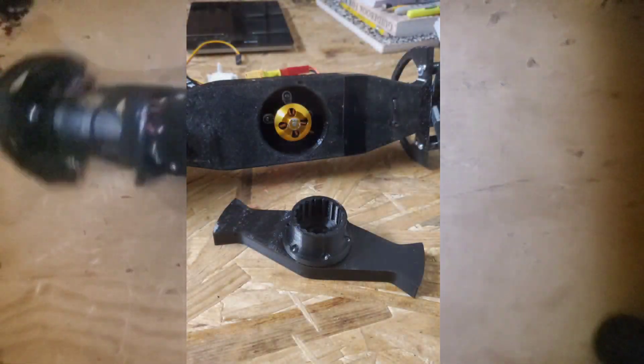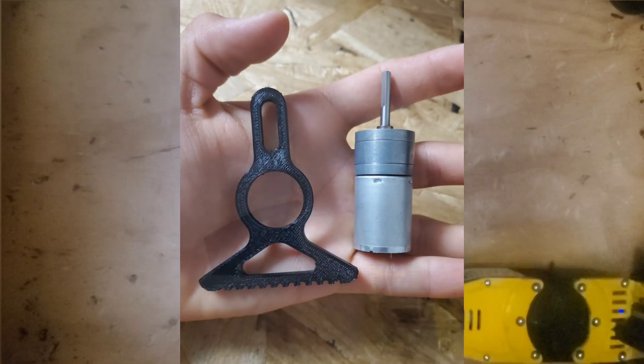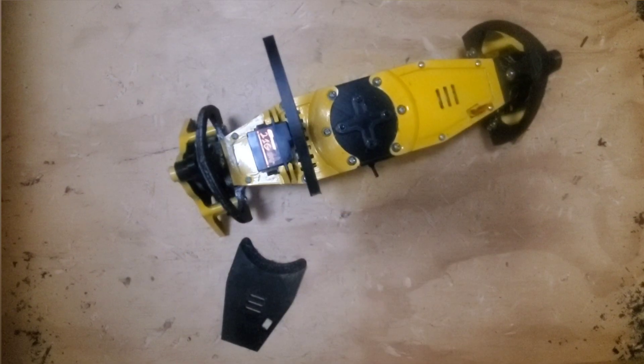For this whole build I was using parts I had available on hand. One interesting result is that I was using 25mm gear motors, which are usually used in a beetle weight — a whole other weight class up. These are about 13,000 RPM 6-volt motors that I'm running at 3S, so these things are going to be going fast. I threw those in, conducted a drive test, and the robot drives very well. I was pretty happy with that on the first try. Next was the weapon, which I got together, and everything seems to be working pretty well.